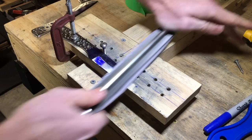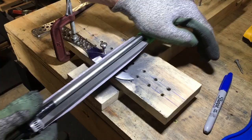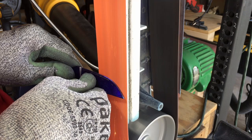I generally take the blade up to around 220 grit, then it's off to heat treating. After heat treating, you can come back to the file jig, or if you're getting better at grinding, go back to the grinder and clean it up with some surface conditioning belts. To wrap up, this is a good way to get your feet wet with grinding bevels without risking ruining a bunch of knife steel — it's faster than by hand and can be used as a stepping stone to full freehand belt grinding. I hope you found this video helpful — please smash that like and subscribe button!